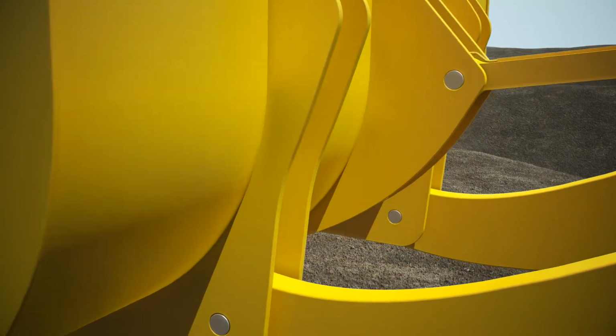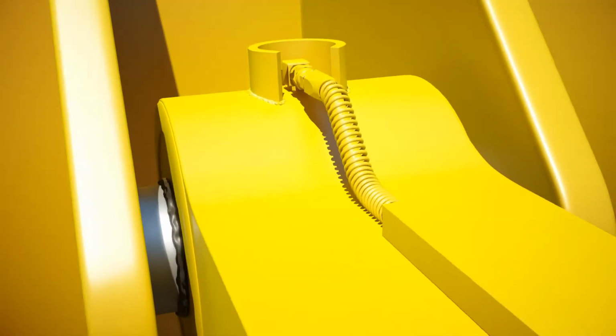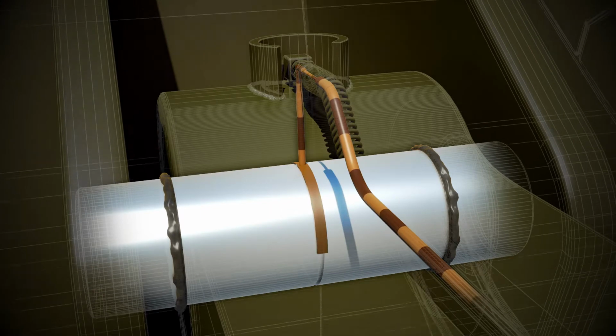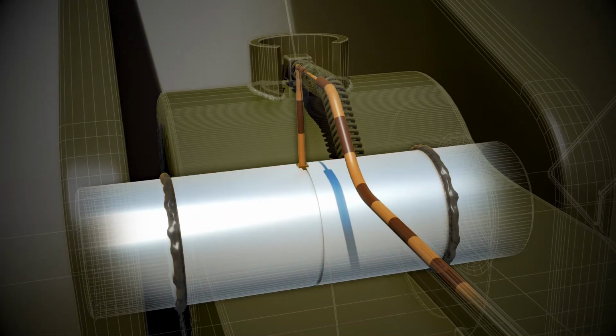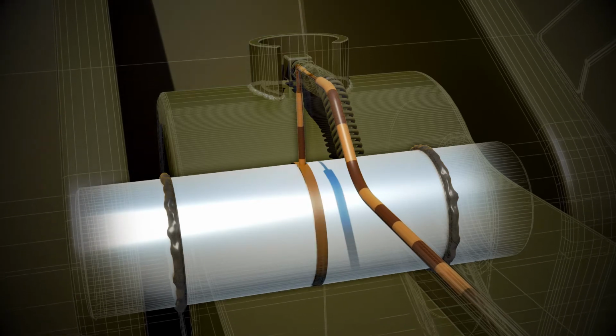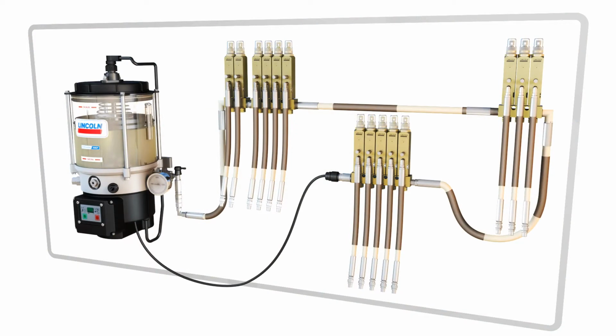Automatic lubrication applies very precise, measured amounts of grease frequently, maintaining the correct amount of grease in the lube points at all times. Lubrication is done dynamically, while the machine is operating, allowing grease to be evenly distributed on the wear surfaces of each pin and bushing. The basic CentroMatic system consists of a pump to supply lubricant under pressure to the injectors